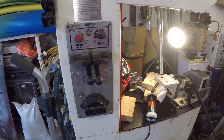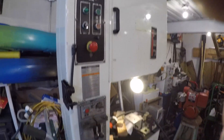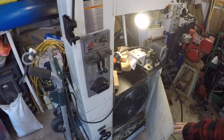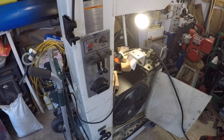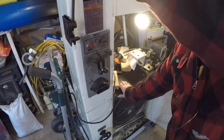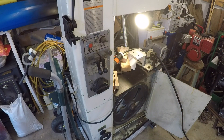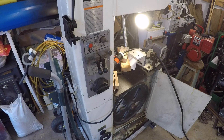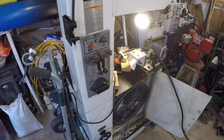One other thing we have to check is that the motor is turning in the correct direction. In this case it needs to be turning clockwise. There's a safety right here, so we've got to push that in. That's running correctly. Now, if it wasn't running in the correct direction, you'd need to switch any two of the leads on L1, L2, and L3. I prefer not to switch the wild leg — I leave it where it is and switch the other two legs, and that will reverse the motor.